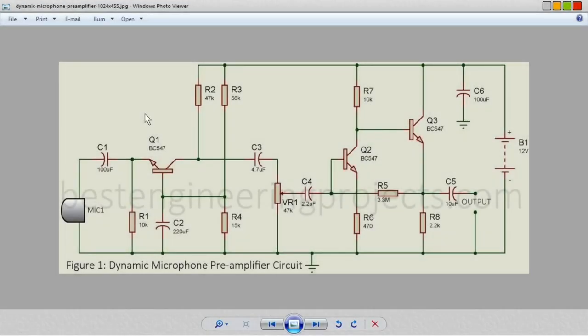Over to a better picture and a better microphone. This is the preamp circuit. It has a common base input right here, and the only real difference between common base and common emitter is that with this circuit, instead of feeding the signal into Q1's base, we're feeding the signal into Q1's emitter. The only downside is that this circuit is going to have a rather low input impedance. We still need to bias the transistor's base with R3 and R4, and we still take the signal out of the collector. Then we go over to the gain control, and we've got another stage of amplification with Q2, and Q3 seems to be used as a buffer, with a little bit of feedback biasing Q2 so it can actually do its amplifying.